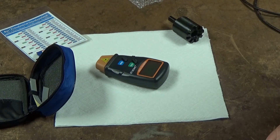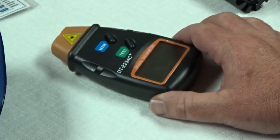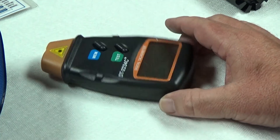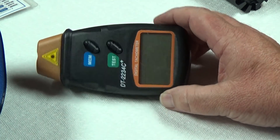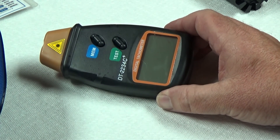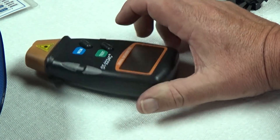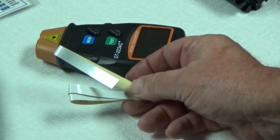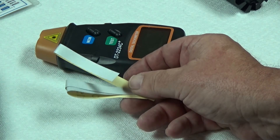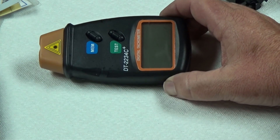Today we're just piddling around. I wanted to look at how close the rated speeds are on the lathe dial to an actual tachometer. It's a very inexpensive device — got this off Amazon for like ten dollars. It's a digital tach. I'll put the link in the more info section. This is a DT-2234C digital tachometer. Simply put these reflective strips — about a half inch — stick it on a spindle or whatever you're working on.